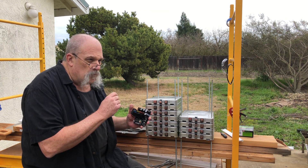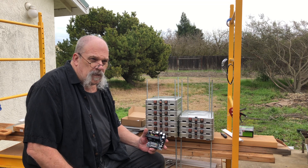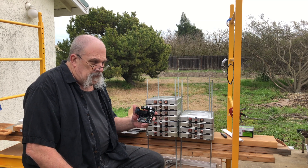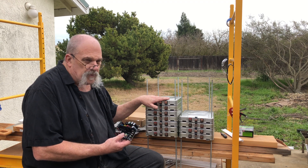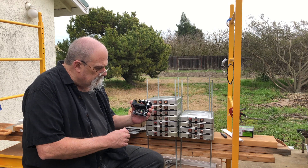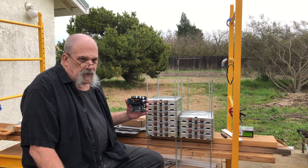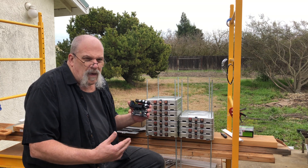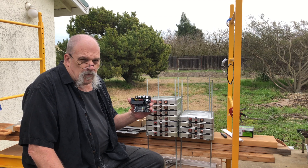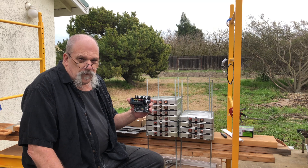I set the voltage because it wasn't exactly a match to what the cells are — I had to set it at 8.3 volts. 8.4 volts for each module is the maximum, but because of some line losses these ended up at 8.27, which is about right where I wanted them. Some of the bigger chargers go down to like 2 amps and then shut off; this one goes all the way down to zero. One thing I don't like is it doesn't actually shut off — it just goes down to such a low amperage that it's not charging anymore. It just sits there.